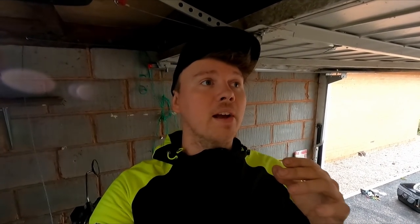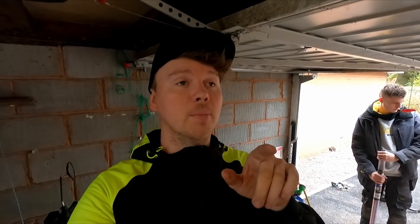We're going to do the one cable over because the gas and the water came through in the same boxing. It's like a downstairs boiler because it's a bungalow. It was a floor run boiler over on the far side of the house where the water and the gas, both the main stopcocks, come through. So we're going to do a continuous loop, not cut the cable.